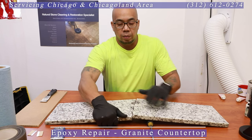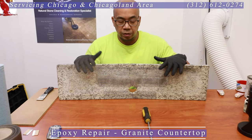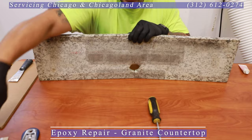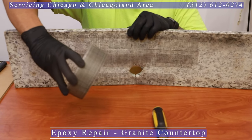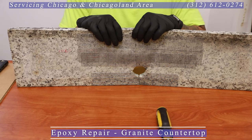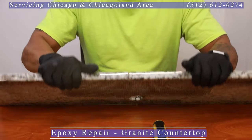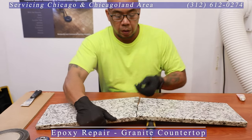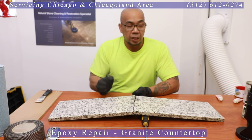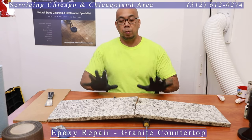As you can see, this is a cracked piece. I'll turn it over upside down so you can see it. The piece is clearly cracked. What we have underneath is the webbing — this is cement board backing tape — and I'm using this to help stabilize the piece as I seam it together with a two-part epoxy product for stone. Laying it flat, that cement board backing piece allows me to keep my pieces in alignment while I mix my stuff.